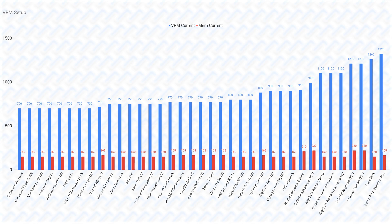All I'm saying is that this time around, even with the reference spec VRMs, they're all overkill, so the VRMs should be the least of anyone's concern when buying an RTX 4080. It should only be a concern when you're comparing two different cards with similar cooling and power limit performance. In that case, there's no reason not to buy the card with the better VRMs.